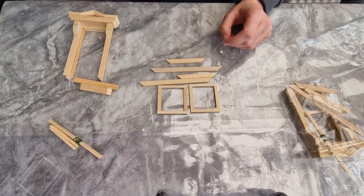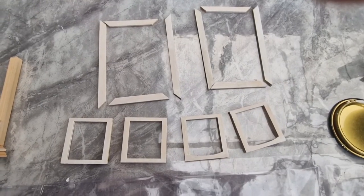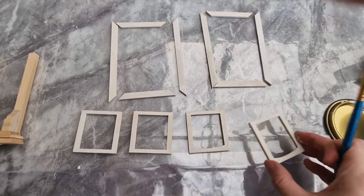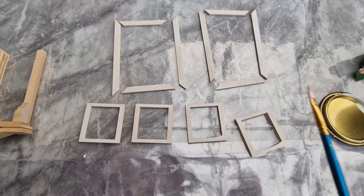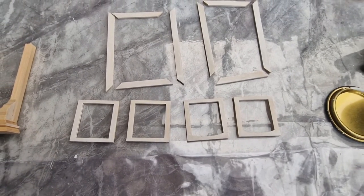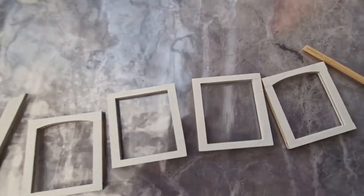Okay, so that's all the frames with the first coat of white. We'll wait until that's dry and then do the backs of these frames — these don't need doing on the backs because they'll obviously be against the wall. I'll just have a light sand and repaint, and these ones will need sanding back and then the backs doing as well. The doors took three coats so I imagine these will probably take three coats as well.